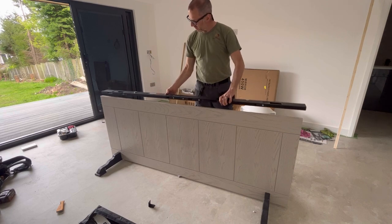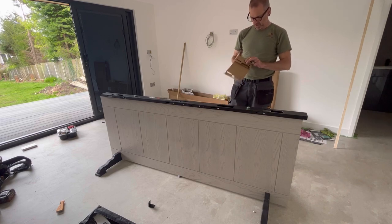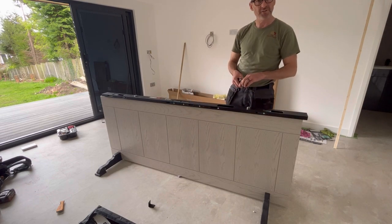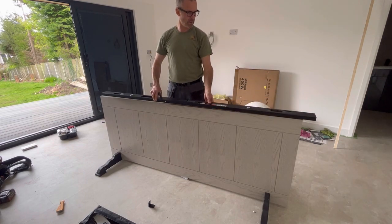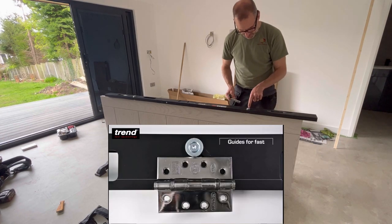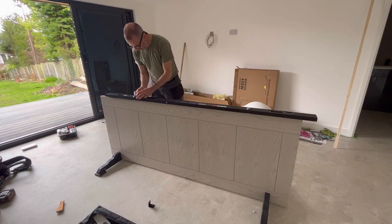So the first thing you have to do is set your hinge. You get your hinge pack — this one is from Howdens, it's not a bad one. Sometimes Howdens stuff can be a bit cheap but this seems okay. There's a line on the jig that you line up with the inside of the knuckle of your hinge leaf. I must have used these before because I've got the setting right — these hinges are very much of a muchness.